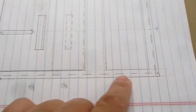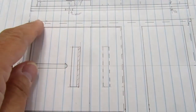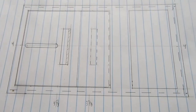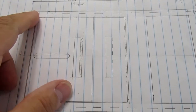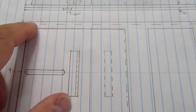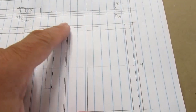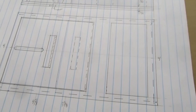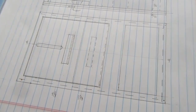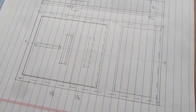use the table saw to shear off a little bit and therefore make nice clean faces instead of the rough glued faces. And then I've got some oak board, some scraps that I can cut down and plane to the right thickness and laminate those on around the faces just to hide the edges of the plywood and make it look decent, and then I can probably varnish the whole thing. And it should match the test equipment support table that the whole thing is resting on.